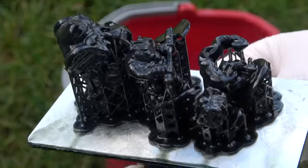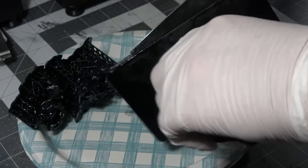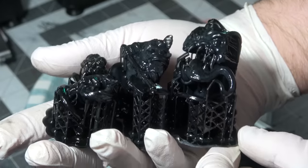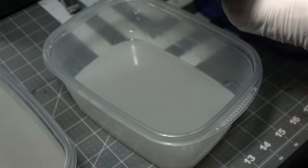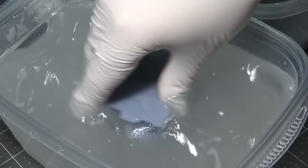When I'm done in my backyard, all I've got to do is go inside and take these prints and scrape them off of the build tray. And then if I have any excess resin on there, I can scrape that off too and clean it with water. If I'm using the other resins, I have to clean everything with alcohol when I'm done. And you've still got to take all of these things and wash the alcohol and figure out a way to dispose of that alcohol.